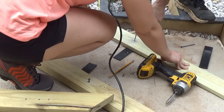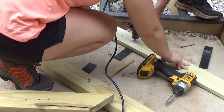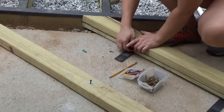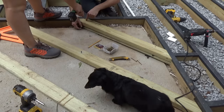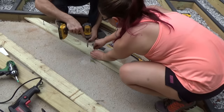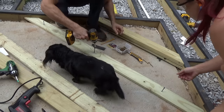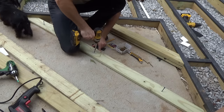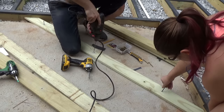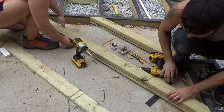As I mentioned, wood in direct contact with concrete will rot faster. So, we stacked plastic shims underneath the entire length of the boards and secured them with the concrete screws running through the board, through the spacer, and then into the patio. If you need a little more space to get things lined up, you can also use a piece of composite trim. I tried a number of combinations before finding that my best option was the shim plus the 1x4 plus the 2x4 option. Had this been a little higher, I would have been able to use the composite trim.